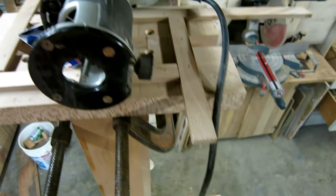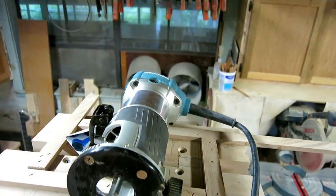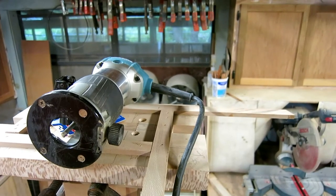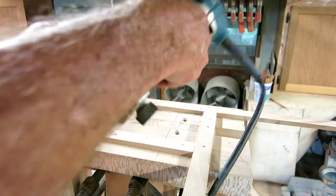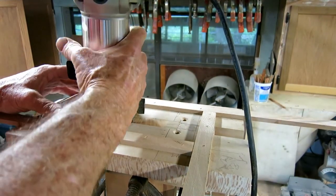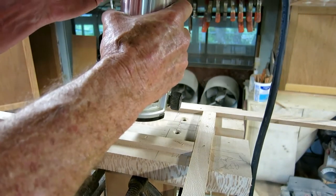Working up here is like working on your bench with all the tools on the floor — kind of a pain. I cut the first one and it's just a little bit looser than I was hoping, so I got a piece of cardboard to keep between the guide and the router on the next pass. I think that may make it perfect.